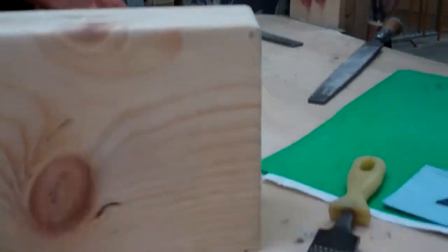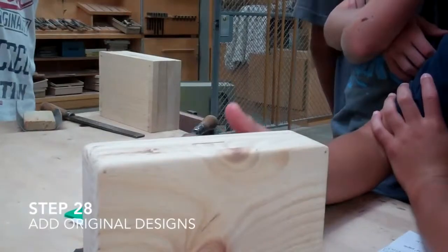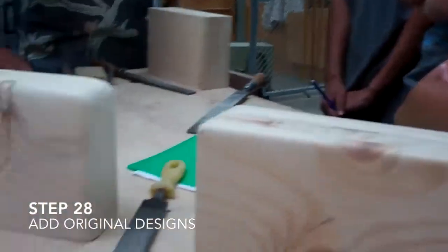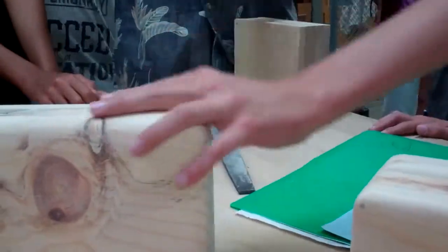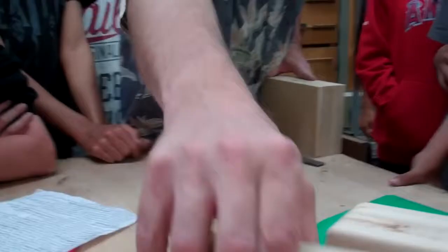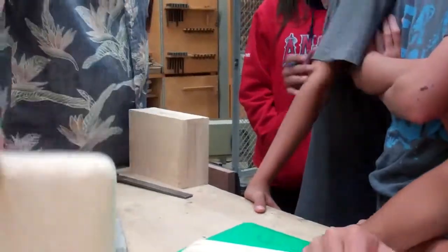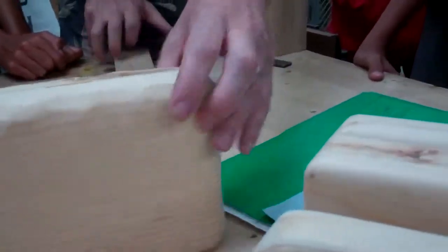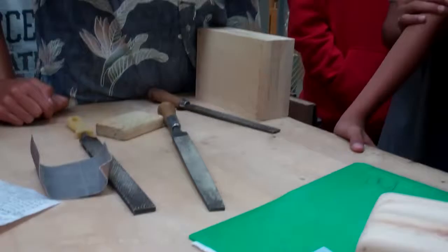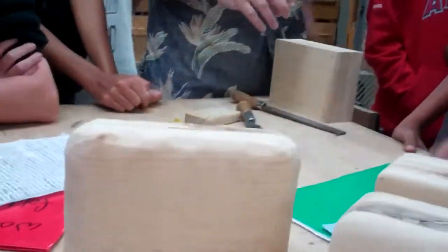Here are some examples if you want to spend time to make it look better. If you want to round it a lot, instead of using just the smooth file, you would use the rasp. This will take off a lot of wood but it will make it rounded, then you'll sand over it. If you're going for a circle shape, that's using the rasp — not just rounding it, but taking out part of it — then sanding smooth. We're trying to get rid of all the edges. I just went around this with the big rasp — I call that my Flintstone bank.